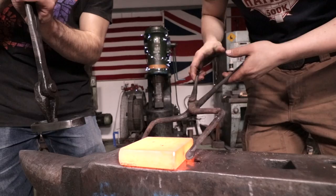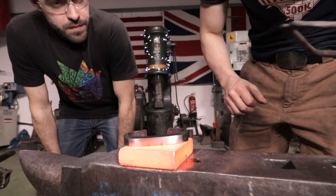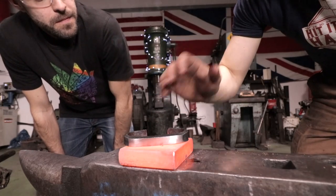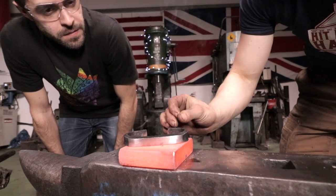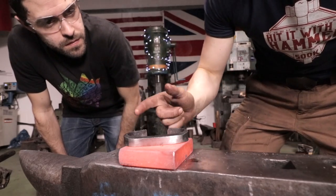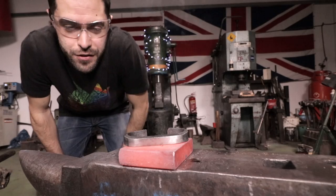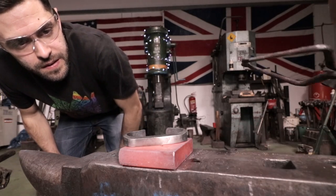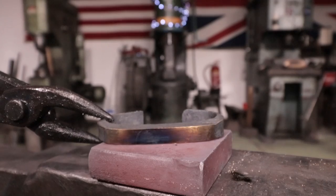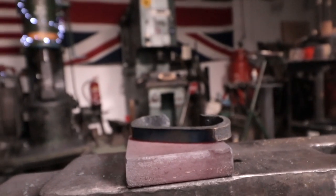Now that you've hardened it, I'm going to take this hot piece of steel — you can just drop that right on there. We're going to conduct the heat from the hot piece of steel into the cold piece of steel, bringing it up to about 250–300 degrees Celsius — this is going to give it a nice temper. After hardening it's super brittle — it's hard but it's brittle. Here we're going to retain a decent amount of that hardness but give it toughness and the ability to flex and not break by tempering it. Make sure you check out the awesome video on my channel and also Real Engineering's channel that shows this stuff a little better. What's going to happen is we're soon going to see the colours change — it'll start off as a light straw and then become a dark purple, and then we're going to cool it off in the oil. You can see the blue colour now — look how beautiful that looks. Beautiful blue colour — we can now put it in the oil to stop the temper.